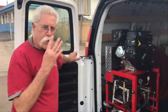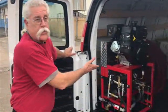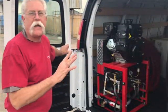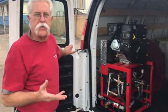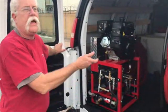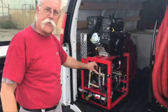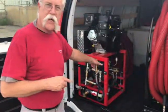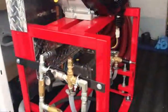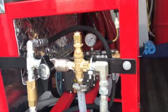This is the simplest, most serviceable machine in the world by design. It fits in a crazy small footprint — I could have put a 29-horsepower pressure washer in this footprint; it fits on the same frame. But she wanted to be conservative and do light outdoor work with medium everything indoors — tile and grout or carpet. Here's the magic trick for switching between full pressure at 4,000 psi and adjustable pressure from 500 to 2,000 psi: we've put a secondary unloader on here. All she does is flip the valve open and it enables the secondary unloader. This is going to have a knob on it before it leaves, so it's real easy to adjust the pressure. She's got a pressure gauge on the head of the pump so she can see what she's adjusting.